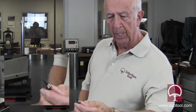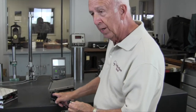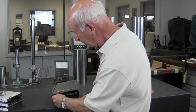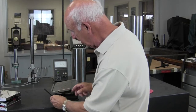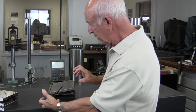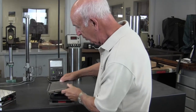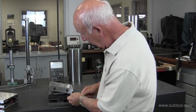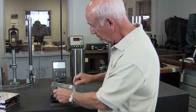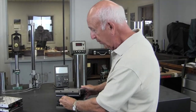You can see there's a taper on this bushing and a female taper the same way inside the inch roll. The way this was designed is that when you lock it, it expands the gauge roll and locks it into the housing. Now you might think that tightening the one on the other side would go the opposite way — but it won't, because this is a left-hand thread. So it too puts pressure going forward, which helps secure the gauge block and makes it good and tight.